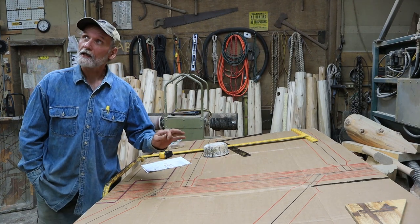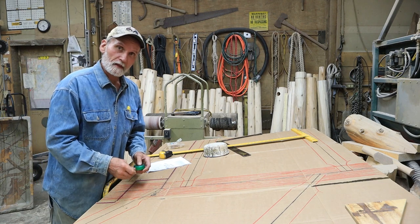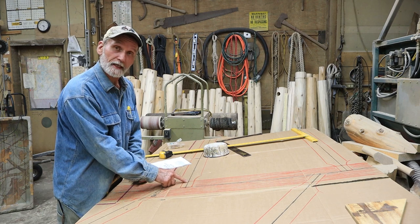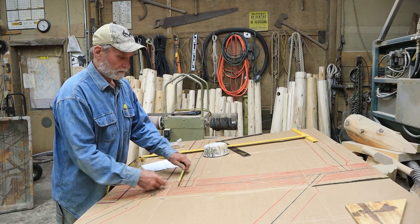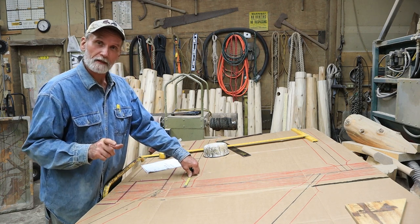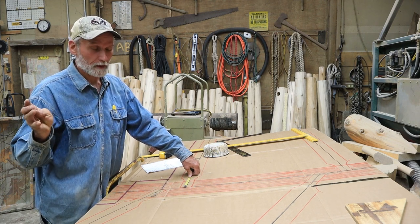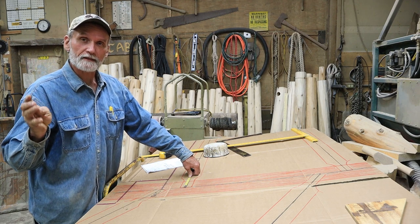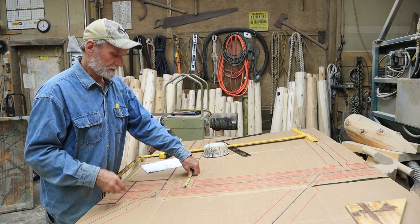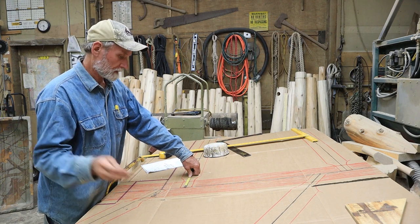Okay, now it started to maybe look just a little bit unique, because from the center of the post coming out, for the length of this tenon, the post at the base were 7 inches. At the top of the post, since we spun them, since they're so close, they average off at 6 1/4 at the top and 7 1/4, 7 inches at the base. So they change. We don't have to deal with that change so much, not a big deal.